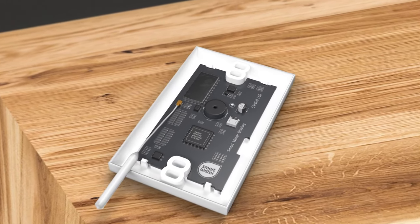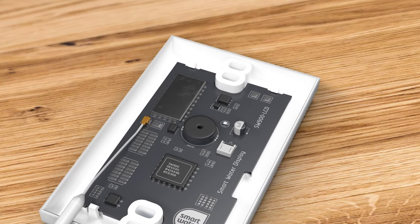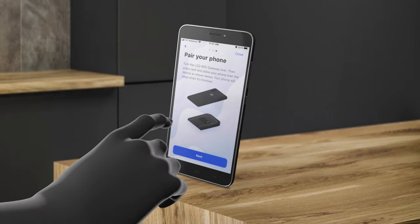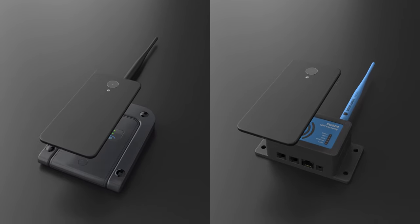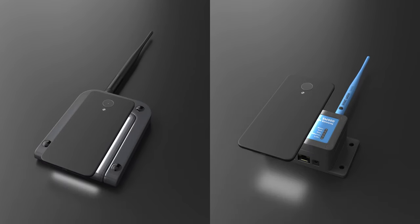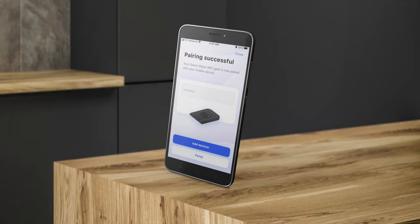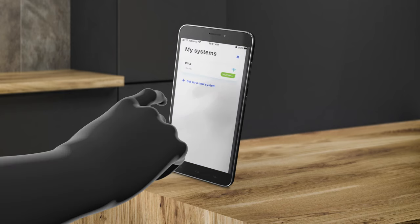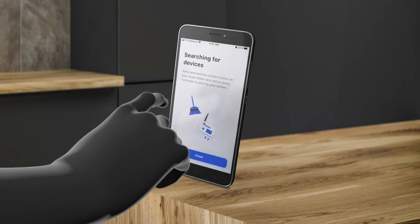For the wall-mount WiFi LCD keypad, the BlinkUp area is the PCB on the back of the product. Make sure the product is connected to WiFi before mounting onto the wall. Press the Next button and place your mobile device screen down directly on top of the BlinkUp logo. Your mobile device is now connected and the system can be viewed and managed from the SmartWater app. If you already have a system set up on the app, simply go to that system and press Add New Device — this will allow tank senders or pump controllers to then be added.